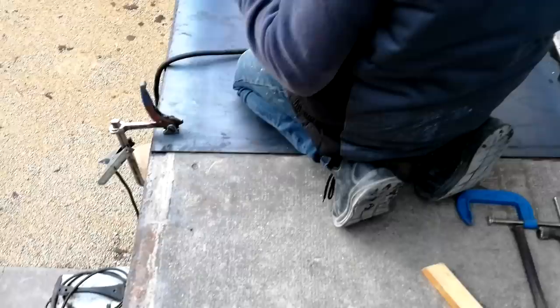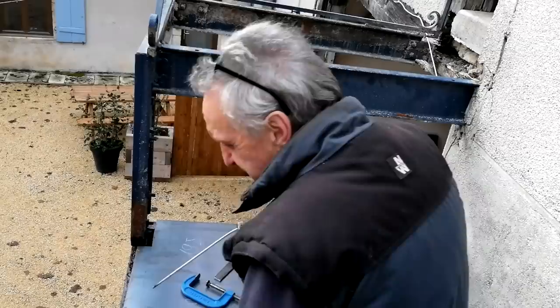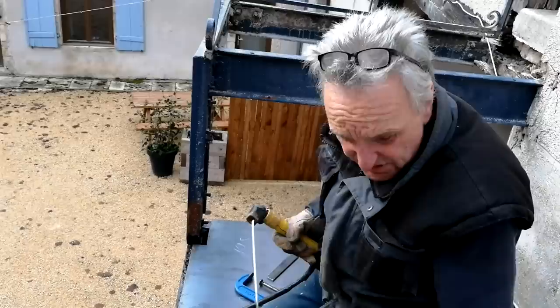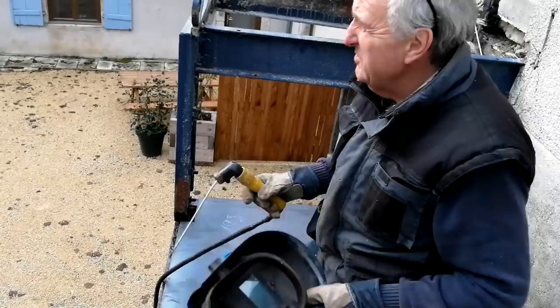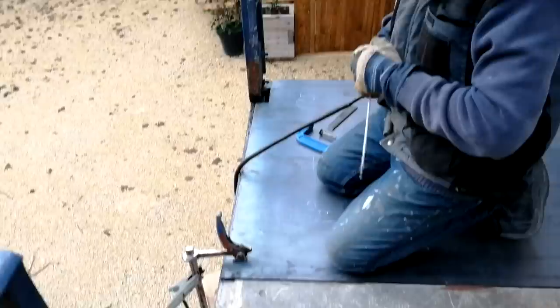To use MIG, which is what you would have, because it's quicker and you don't have to use these welding rods, you see. But unfortunately, that's got an argon gas surround around it. And if you were to use it out here, the gas would get blown away by the wind, and the weld would get oxidised, you see. Okay, so that's good to use, but not when it's windy. It's good in the workshop, indoors. But on site, it's very good if you've got a lot to do, like making balconies and things. You can use that in the workshop, but unfortunately here, as I say, you can't use it because it's blown away.